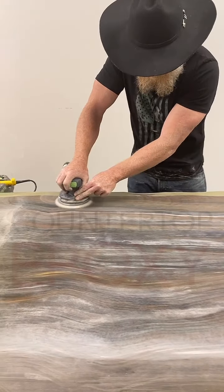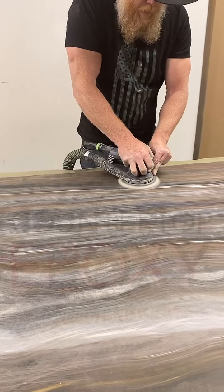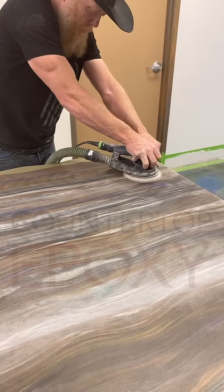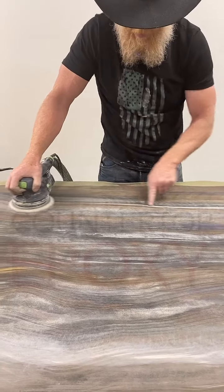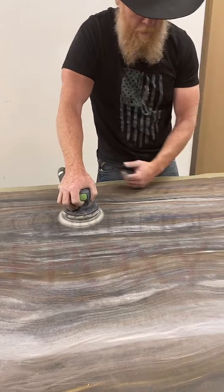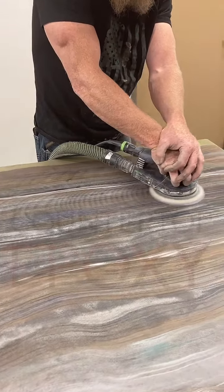And the epoxy is going to start looking a little more like epoxy, but it will be very flat. When you sand and polish an epoxy top like this, it's so much prettier than anything you ever pour, because you get that cut look. Like right here, you see a totally different pattern in epoxy than any way you could have poured it. You get the really nice bisected angle because of how we sanded and cut the top off.